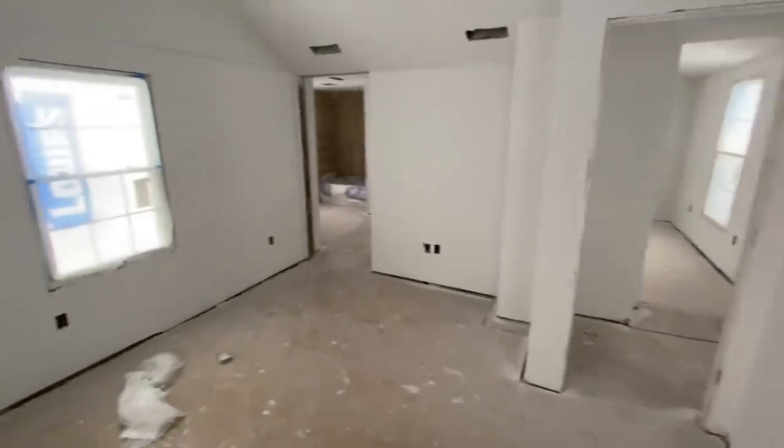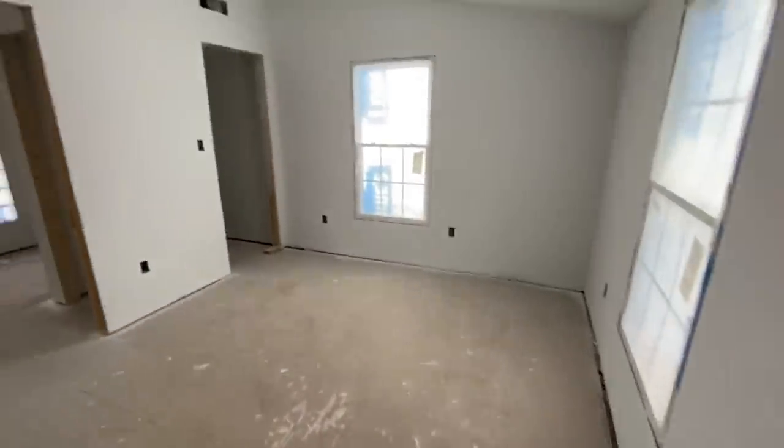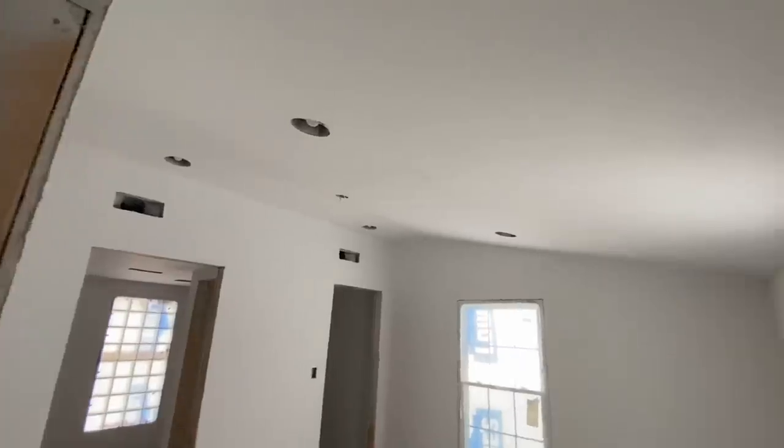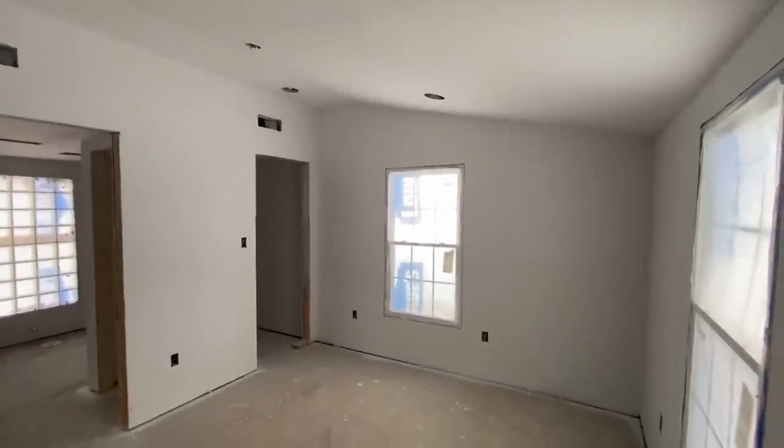Again, sprayers are great. Spraying in all this stuff just gets the paint on the wall quick. And then with that back rolling process, again, it's just for adhesion, just to press the paint into the drywall. Finish it. It makes the uneven spraying more even.